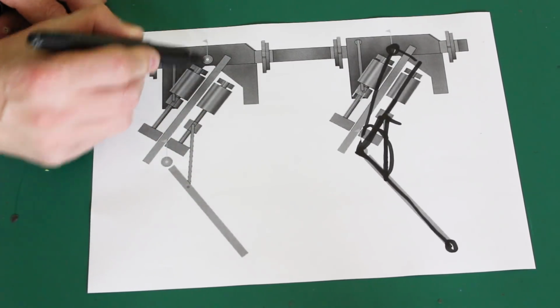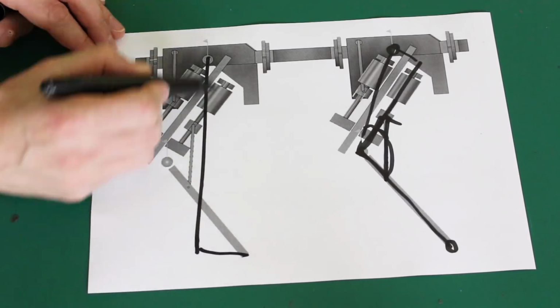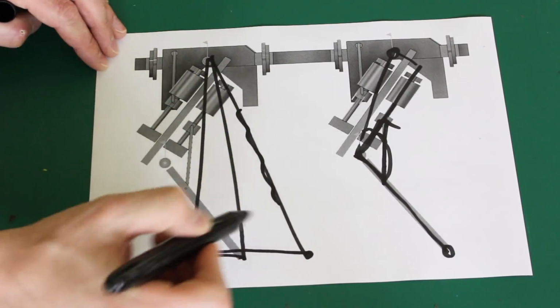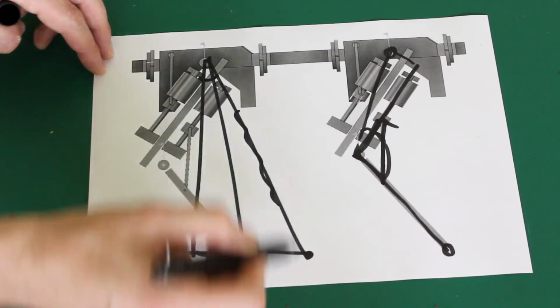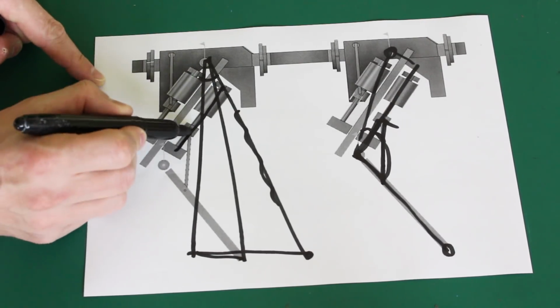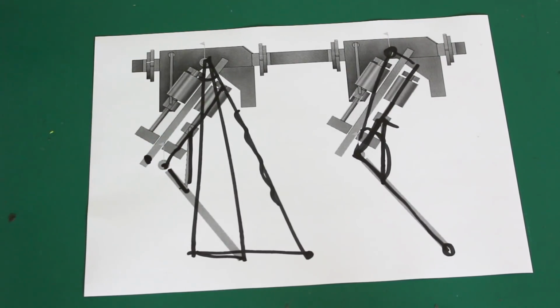So the rest, to move the foot in a straight line this way, is just a triangle here like this. And if I want to move it to this point, it's just a triangle like this. And that tells me the new leg length, and pretty much that's it, the leg length and the angle up here. So that should be very easy to make that foot then drive in straight lines, and the same with the sideways axes as well. And that's all thanks to basically offsetting this ball screw here so that this makes a perfect triangle and there's no weird offset with the joint over here, which would be much harder to solve.